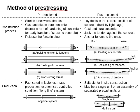The circumstances for the applications of pre-tensioned and post-tensioned concrete differ. Pre-tensioned concrete can be fabricated in the factory, and mass production can be done, making it more economical and under controlled conditions. It can be fabricated using the long-line system, where several pre-stressed members can be cast together using one tendon, which speeds up the fabrication process.